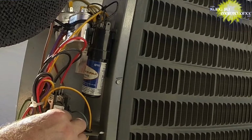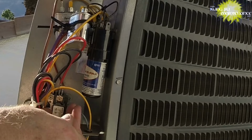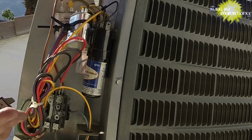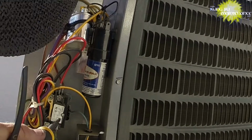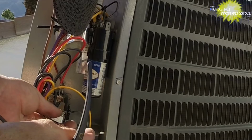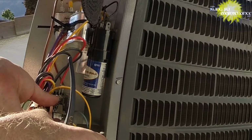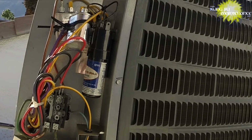And I'm just gonna peek at the contactor, make sure everything's good there. It's got this little dust cover over it, which in some ways is annoying. All the points look brand new, so that's good. I feel better that we checked it. That thing's all bent up, broken, so that ain't doing much. It's not critical for it to be there, but dust out of there. Just the darn stickers holding it together.